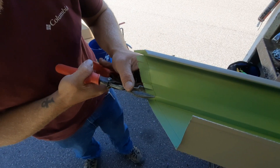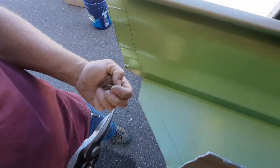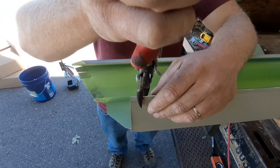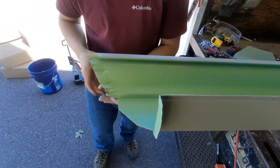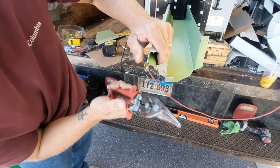Flattest spot, two down there. Angle this one down to the corner so when you fold it over it's not in the way. Take this, do a straight cut on it because that other gutter's coming right here. Back corner, same thing — come out on both of those. This is where you're putting your tape, so make sure that's perfect. Fold that over, I take the back of these snips, bending these tabs. These are all getting covered up with the next gutter.